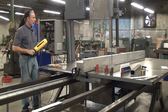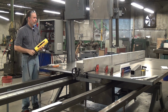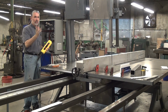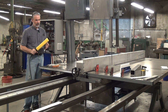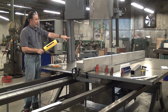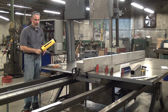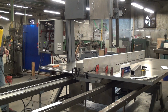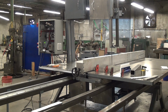But when you are actually working with a workpiece, making a cut, you want to make sure the blade is running before you advance the workpiece. You don't want to ram the workpiece into the blade if the blade isn't running. You might damage the workpiece or your blade. So the logic suggests that you start the saw blade motor and then start the table forward. Once the saw is running, press and release the forward button, it'll go forward until you press stop or it reaches the end of travel. That's the basics of the controls. All the rest of the features are covered in other videos.